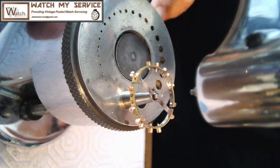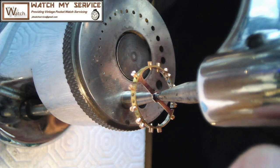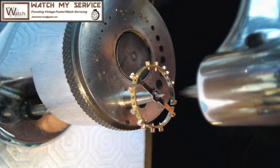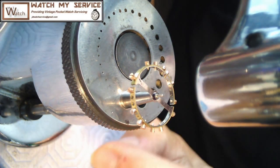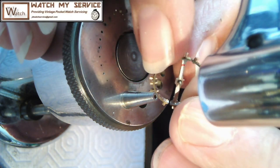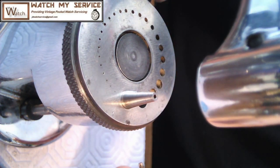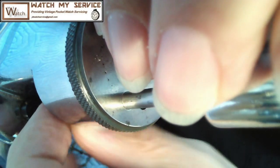I've put it in there and pounded it in. Because I'm narrating you don't hear the sound of the hammer - that's my simulated stake hammering right there. So I've hammered that in and now it's friction fit in that hub. These were made so people could bring their watches back and get the staff easily replaced. It's convenient and the steel being used for this hub is much stronger than the balance material itself, so it's not going to move at all.